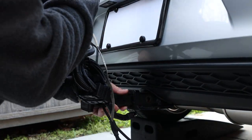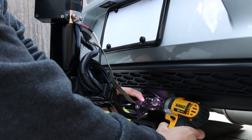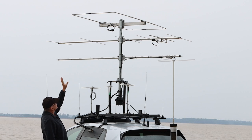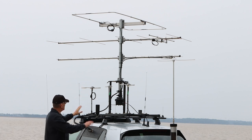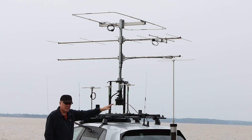The Scorpion goes up when I feel like it — it's convenient enough to put on and off easily, but ordinarily the car just has the verticals. The bands I'm covering right now: 6 meter, 2 meter, and 432 megahertz on the Yagis, and then on the loops I have 2 meter, 432, and 222.